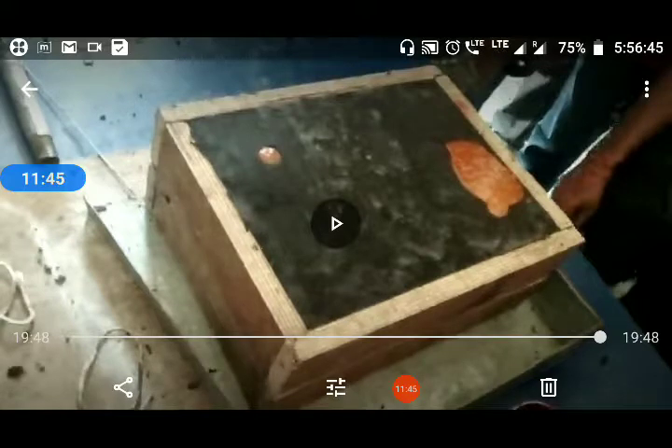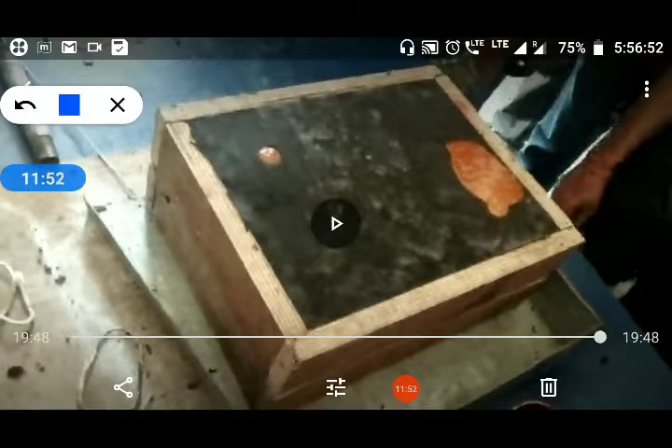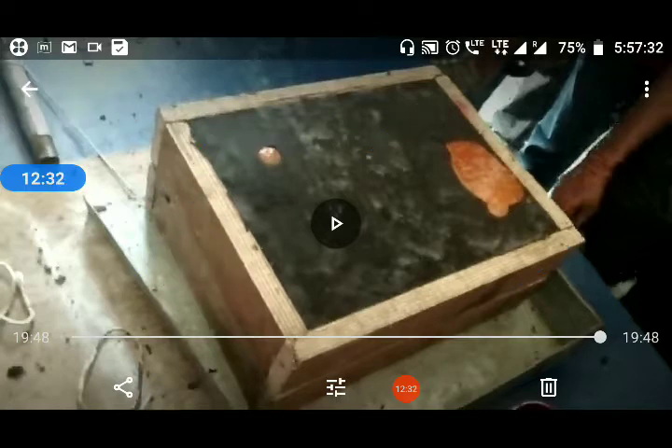Allow the assembly for solidification. After solidification, you can remove the molding box. Remove both molding boxes and withdraw the casting — that solidified product is nothing but your casting. At this moment, we end our practical number one. You will now understand what is a pattern, what is a flask, how to make the cavity, and how to use different tools to make the molding box. The upper molding box is called the cope and the lower molding box is called the drag. Thank you very much.